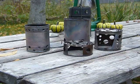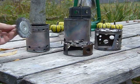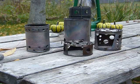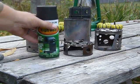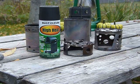After we've got everything burned out of these, I'm going to take the rotary tool and some wire brushes and my regular drill and a good wire wheel. I'm going to clean them up as good as I can. Afterwards, I'm going to give them two coats of high heat paint. I like this brand here because you don't have to bake everything to make it set. You just spray it on and let it dry. I like to give them two coats. There's enough paint in one can to do a whole set. And I like to hang on to the leftovers for touch-up. So, we'll get that done.